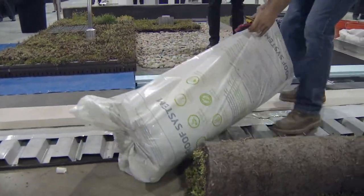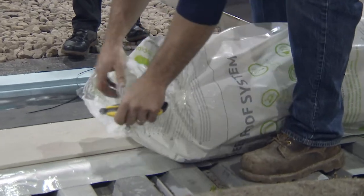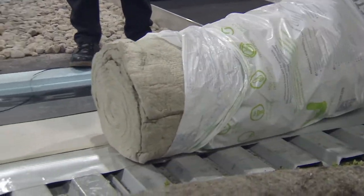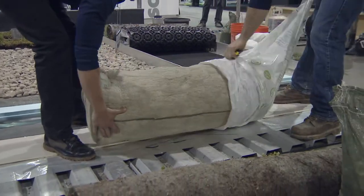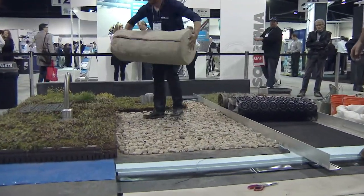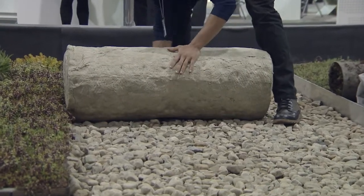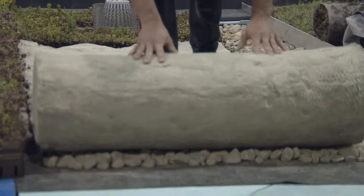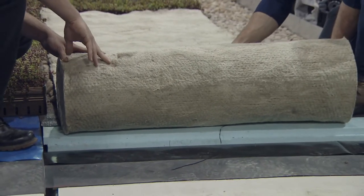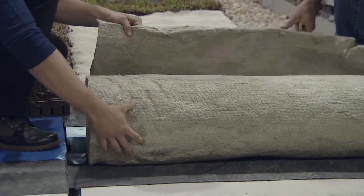The mineral wool comes in one-meter width by five-meter length rolls. It's loose laid on top of the stones and can be easily cut with scissors or a utility knife. It would be cut leaving a setback away from any drains or penetrations — you install it only where you're going to be installing the plants. If you don't want plants to grow around a roof drain, you don't install this material immediately around the drain either, since it encourages plant growth.